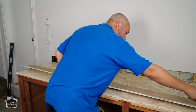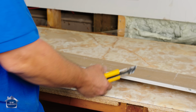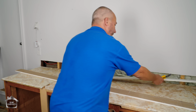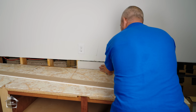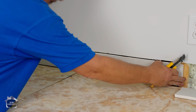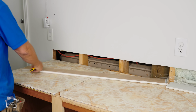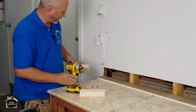First tip, when you're cutting drywall, you're only cutting the paper, okay? And then it breaks off every time, no issues. And what we're gonna do is line this up for the middle of that stud to where I got it cut to. This way I have a joint in the middle of the wall, and then we'll do this one the same, nice and quick. No measuring tape needed. I'm gonna tape this later.